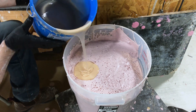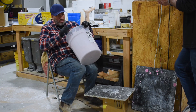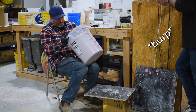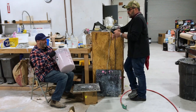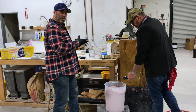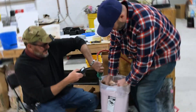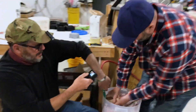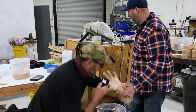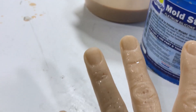You really nailed it — look at that. Burp in the mold. Come on, baby, give me a little burp. Good. So when you're rolling this, you're getting the bubbles out? Yeah, in case there's a little bubble trapped in the fingers. Pinch the butt — that gets the air out. Oh wow — once I paint it, you won't see all the little bubbles on there. It's just under the surface.